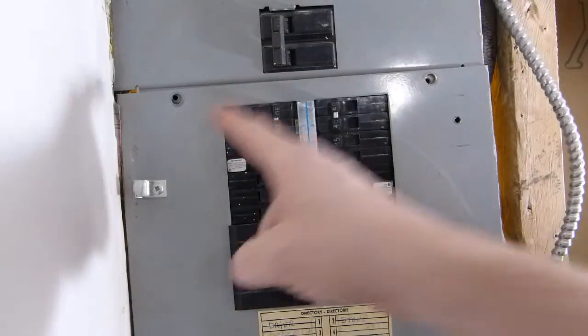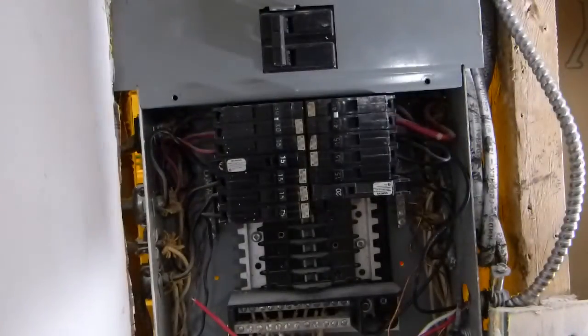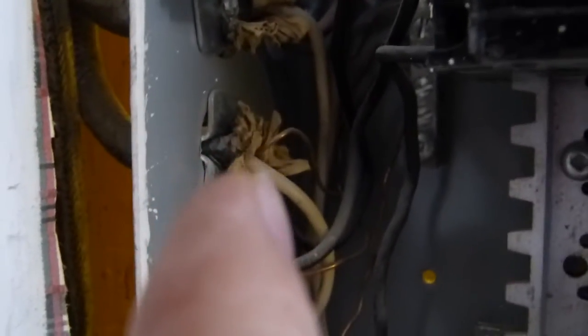Bring a screwdriver — just a single screwdriver — and take out those four screws that hold this cover plate. You can do this safely, as long as you don't touch anything inside. Looking only — visual observations — absolutely no poking, no touching. When you take a look at the insides, you can see that the 1971 jacketing on the cables has this silvery finish, and the cables themselves have this paper insulation. My finger is against the lens — I'm not putting my finger inside the breaker panel, I'm at least a foot away from it.